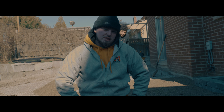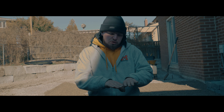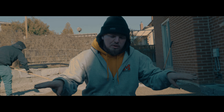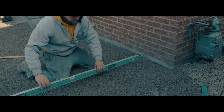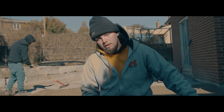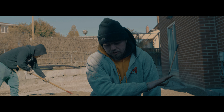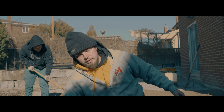This is grading — the final step before you put on the stone. That's why I'm taking my time with the levels. Once you set the grade and drop the stone, that's it, the stone is laid. It's important to grade well: number one, you need a level flat surface instead of bumpy stones. Number two, I'm making sure water runs away from the house — if your grade goes towards the house, water runs through your concrete, erodes it, leaks, cracks, etc. And I'm also making sure it goes level across just for aesthetics.